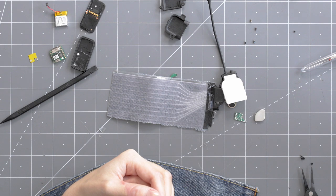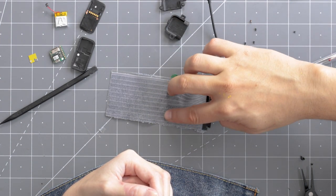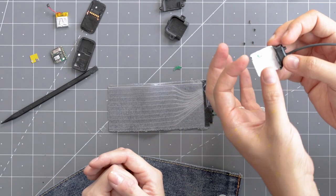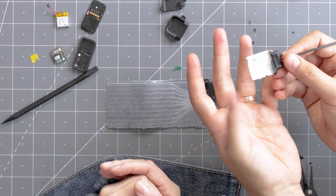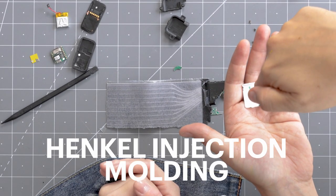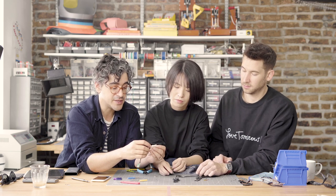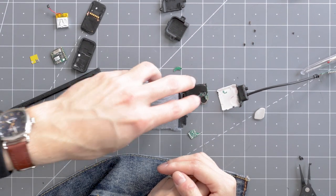It's interesting they didn't put the step-up converter inside the patch and instead put it all the way up in the module. With ten lines on the patch but only six pogo pins, there has to be smarts in the patch figuring that out and talking back to the module. The construction involves a sealed wire coming up into a tray — not a full housing — that holds the PCB, which is soldered to the leads. Then they put it in a mold and over-mold it, possibly using a Henkel-style material designed for deep-sea electronics. These materials are really expensive, so they're used very sparingly and only in certain parts.